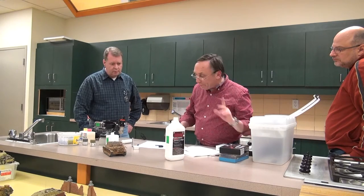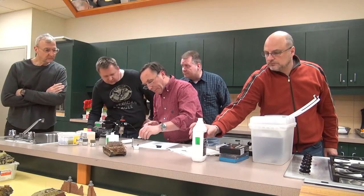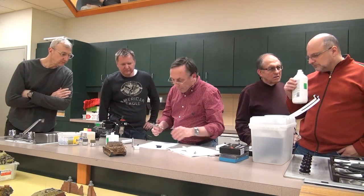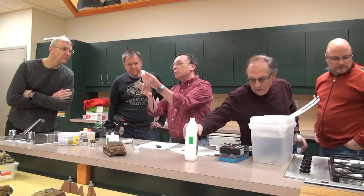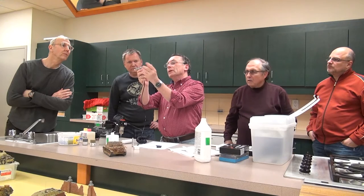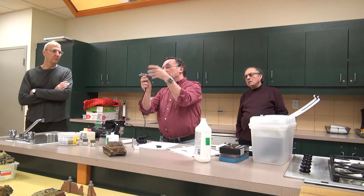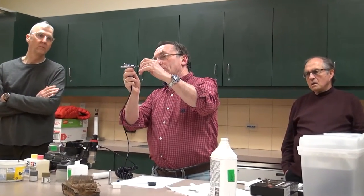Now, what you might find sometimes after a long time of using it, the needle might get jammed. Sometimes, when you take the front cover off here, you can see where the needle sits. I always run it in reverse, the blunt end in first, that lines everything up, and you just push this through here. Now you can see the needle is protruding by maybe a couple of millimeters. As you pull this back, the needle goes back and forth. What will happen sometimes, you get a build up, and the needle won't settle in there properly. It won't protrude all the way through.